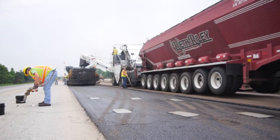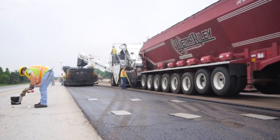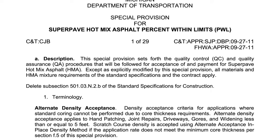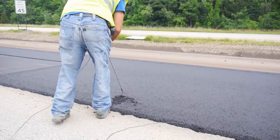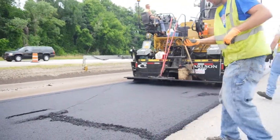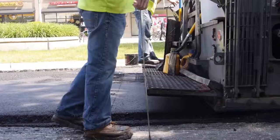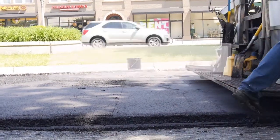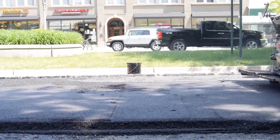One combined sample for behind a paver consists of a minimum of three increments collected within 10 feet longitudinally and across the full width of the paving mat. To obtain sample sizes and the number of samples required, refer to the special provision in the contract. A composite sample is defined as a sample that includes HMA material from across the entire pavement width. These sampling procedures may involve hazardous materials, operations, and equipment. It's the technician's responsibility to be familiar with and follow safety and health practices and to determine applicability of regulatory limitations prior to sampling.